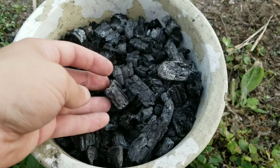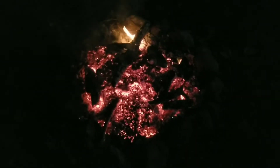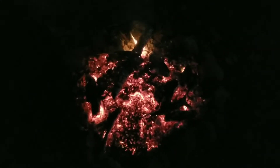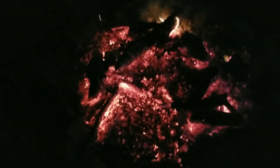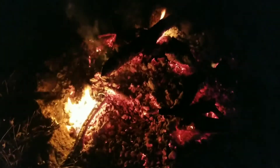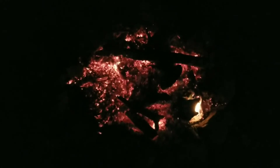In my opinion, storing it is too inefficient. It's best to just make the charcoal and use it the day of while it's still hot. Honestly I don't see this as much of a con — this makes a lot of charcoal, and if you do it on a large enough scale there's going to be plenty for whatever you happen to be doing that day. You could spin it as a pro, since you don't need to store charcoal in advance. The other minor con is that the charcoal size in this method is rather small. If you're making steel in a bloomery furnace this is just about the right size, but if you're heating iron in a forge it might be hard to get enough oxygen to the coals given that they'll pack together tightly. It's not a perfect method, it's not a historical method, but as far as I'm concerned it beats making charcoal in paint cans.